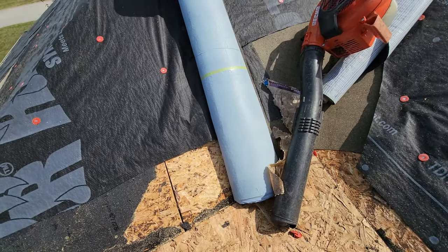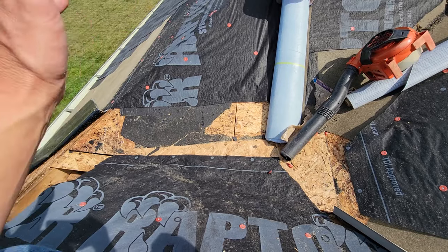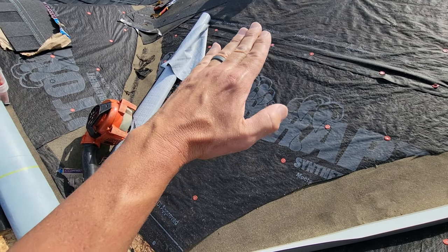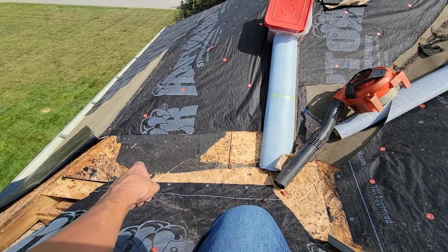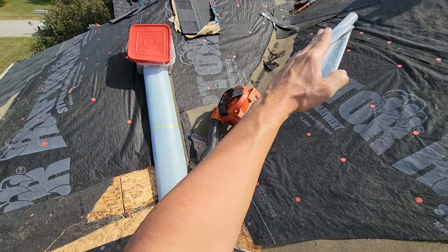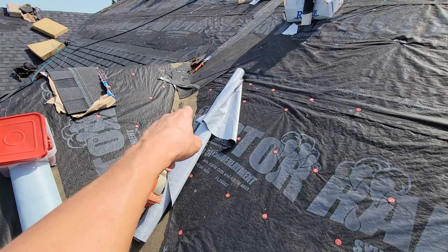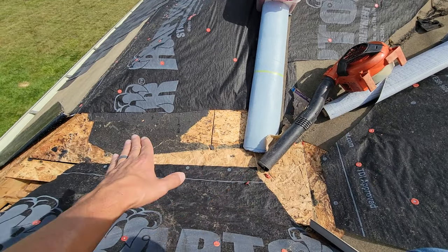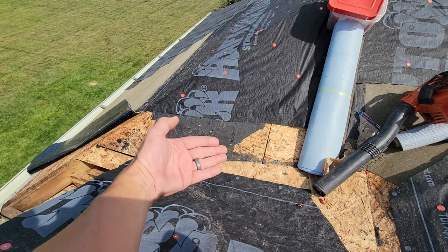Instead of doing all that, something simple — especially on a section this small — is taking some lumber. We're going to run 2x4s from the bottom up here, trying to get to that sweet spot of a 4/12 or greater — at least a 4/12 because we have the room for that. We're going to have a piece of 2x4 as a nailer running up a valley line, so that valley changes direction and draws a straight line up into that region. A new valley line comes down right through here, so that slope — ice and water, shingles — will shoot out. Even if you have an ice dam, it's going to have enough slope for water to eject out of there, not back up into the pocket.